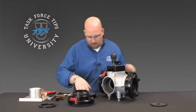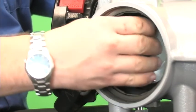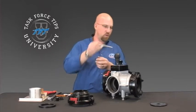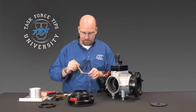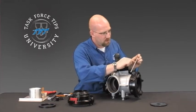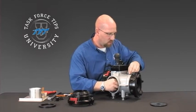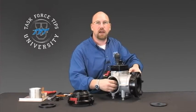The clapper can only go in one way and operate properly. When installing it, the notched end needs to be facing up, lined up with the two cutouts in the opening — push it in. With the shaft we removed earlier, the oblong or egg-shaped end goes in first, pointing down. Apply a small bit of grease to the bottom. On the top of the shaft is a roll pin that will mate inside the groove that we had facing up when we installed the clapper. Press that through the clapper and get it to line with the hole in the bottom of the casting. Once contact is made with that hole, press it in and the roll pin will fall into the notch of the clapper.